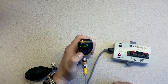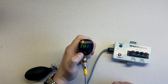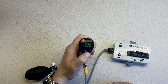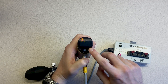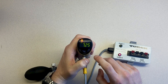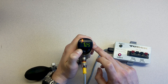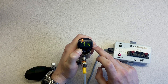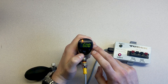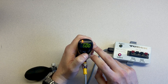Back in the main menu, let's navigate to output 1, FH1, upper switch point, and press the Enter touchpad. Hold the Set touchpad for 3 seconds until the display stops blinking and use the Mode and Set touchpads to navigate to 6 psi and press Enter. This will set the upper pressure switch point.